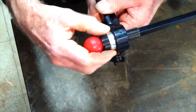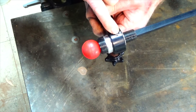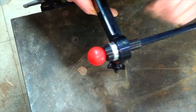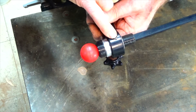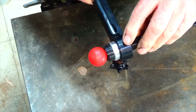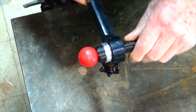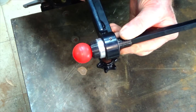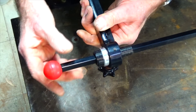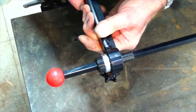At this end I've got a big round eye welded onto that piece of steel bar stock, and this aluminium section is free to rotate if you loosen the screw — and that rotates the whole square steel bar. Stupidly, I put a roll pin in there that fits into a slot in that aluminium piece so it can rotate but not fall out — I really should have used a threaded grub screw so I could take it apart to lubricate or clean it. Now that I've fitted that roll pin I'll probably never get it out without destroying something. There's the 3D printed part — when I made it I made two; the first one was too short and the steel rod was binding when you tried to lift it, so I just lengthened it by about 25mm and that fixed the problem.